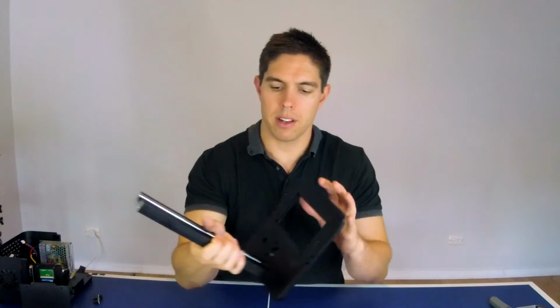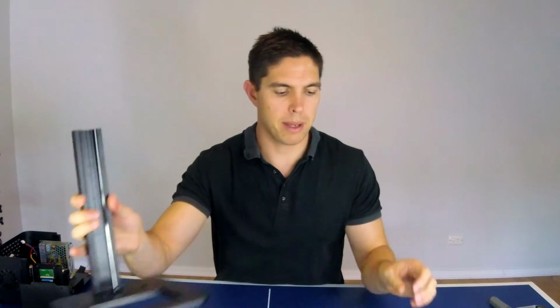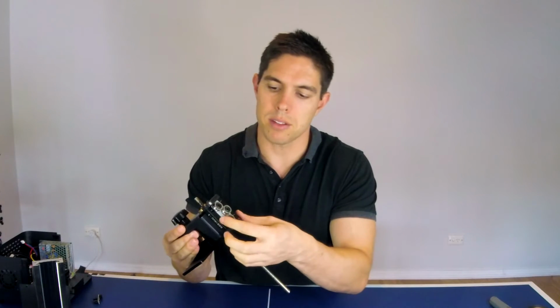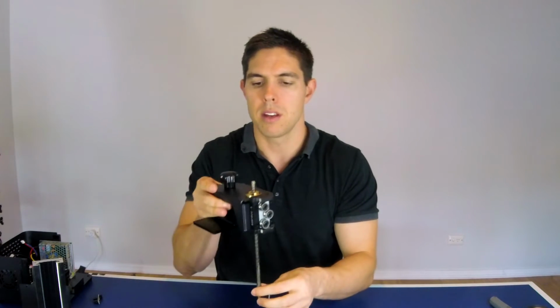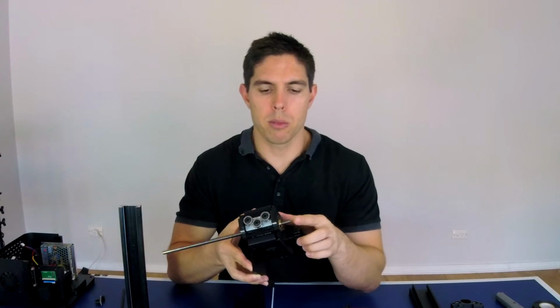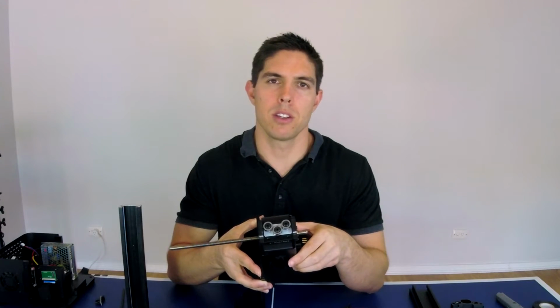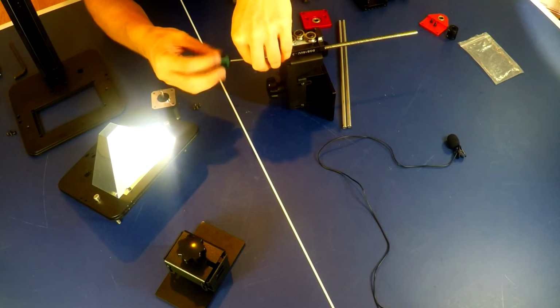At this stage, I'm going to leave the vertical assembly on the top of the printer because I think that's going to be completely replaced by the new one. Pretty interesting to look at how the old one works. Didn't actually use linear bearings, even though it had linear rails, so it just has these normal bearings and it aims to trap itself as it rolls up and down. I think we might proceed by removing the nut and the lead screw and then building the new vertical assembly of the new parts. We're going to start this process by turning our attention to the old carriage.